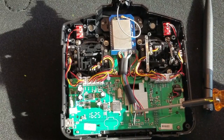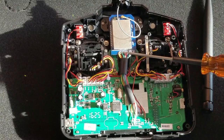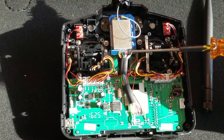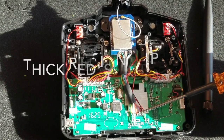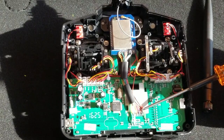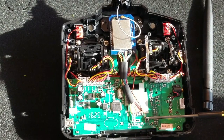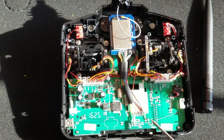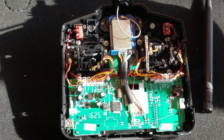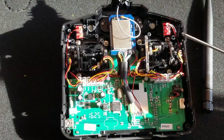For the wiring: yellow to yellow, red power goes to the power point on the board, green goes to the first green connection, ground goes to the ground at the very end of the module, and the first white goes in between the green and red. The thick red wire is your main power. The thin red wire goes to the one on the end right next to the ground. I have two grounds going into one spot, and I'm also pulling power off a small resistor — I used a multimeter to find five volts.